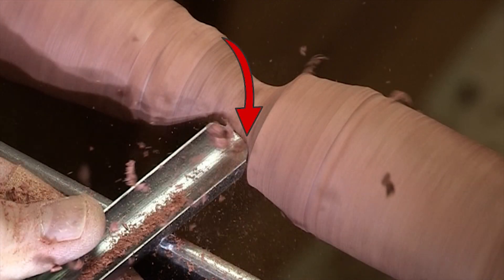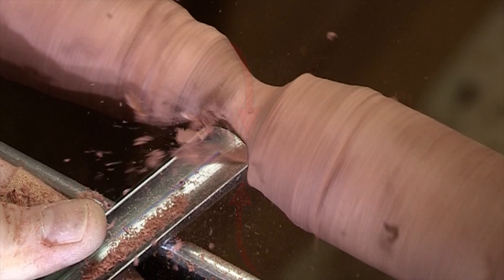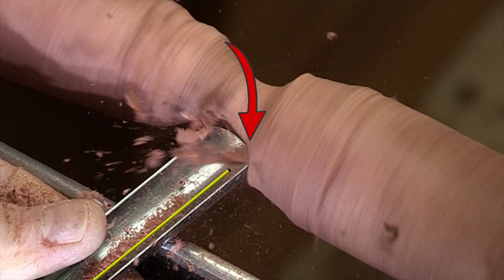It's really interesting because it doesn't take much to make this happen. You can see the edge right there starting to touch — look at the balance, it's just barely off towards the center of the tool. Also, if you notice, there's no bevel rubbing on the right-hand side, so that's going to make it flip even faster because there's no support from the edge of the tool. Now you can see how wide a cut it takes all of a sudden, and it's trying to put bevel support in. But you can see by the yellow line — that is not supported. The tool is not supported at that point, so it's going to try to right itself and flip it over. Hey, it's supported now. Too late.